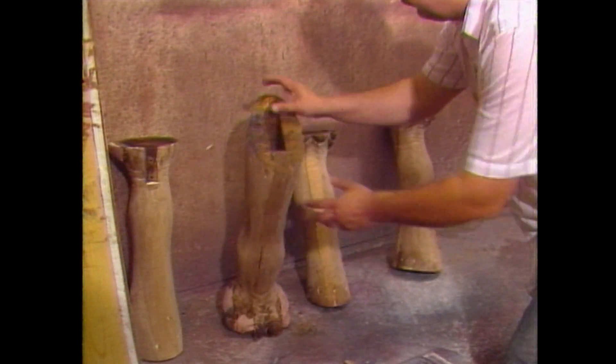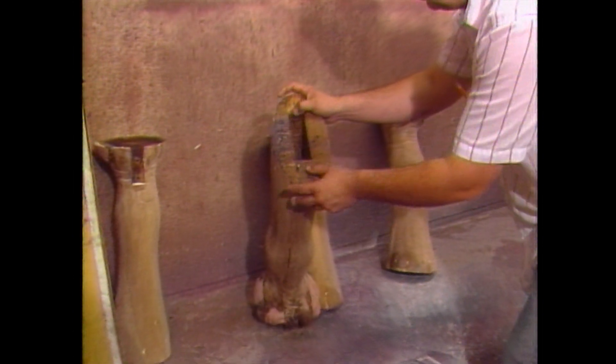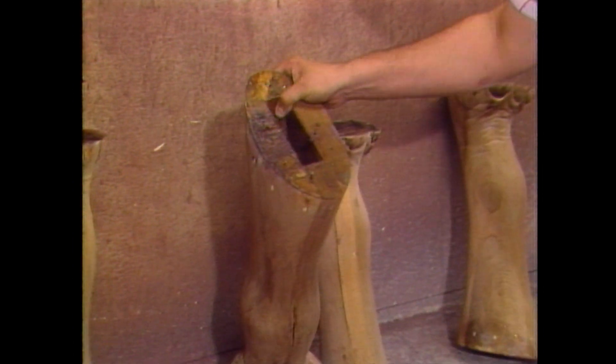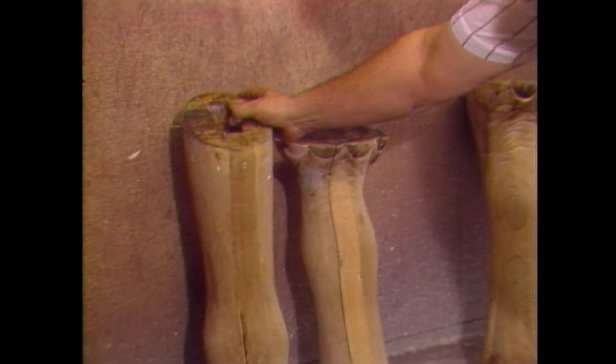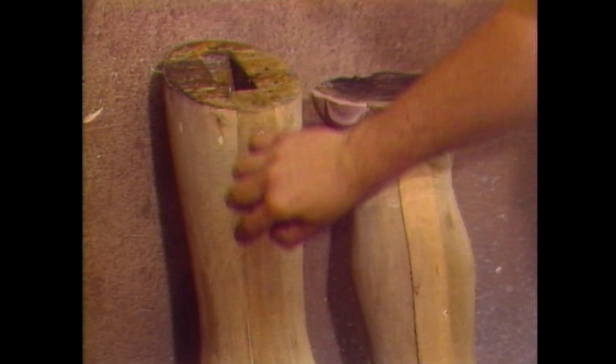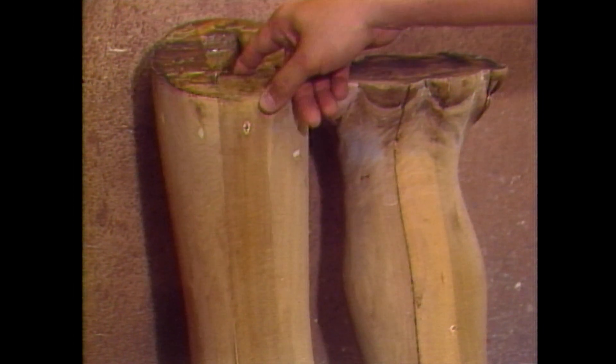It's built up — this is an elephant leg from the piece you're just looking at — and it has a hollow center. This cuts down the amount of wood they have to use and the weight of the piece. What happens over the years is the joints: there's one big board that runs right in here that makes this hollow area, and it has delaminated.